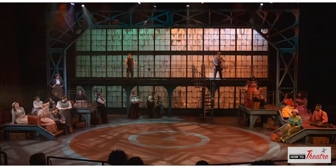We did a lot of steel handrails for this show. These actually came from another theater that made the bottom parts. We wanted them a little bit taller, so all we had to do was weld on these top pieces. We had to cut them down, of course, to make them fit what we were doing, but someone had put this together for a show and they were getting rid of them. Right at the same time, we were doing an industrial looking show too, and we said, we'll take those. Welding is nice because we just had to grind away some of the paint where we wanted to weld and add it on. We had to create a couple more to match what they had. But now you've got a super strong handrail system up there.